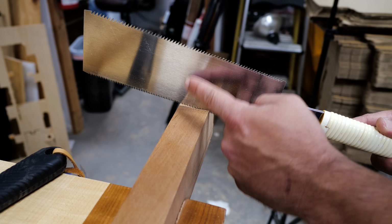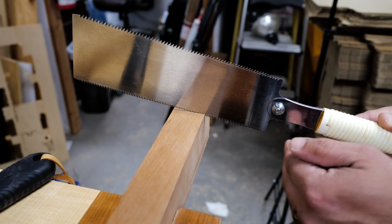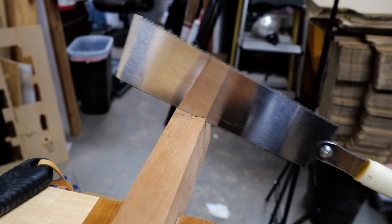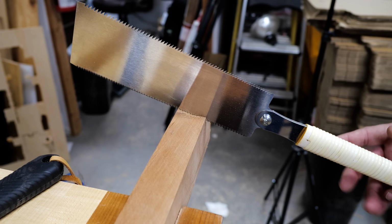And when you're cutting with a Ryoba, you can use 1 or 2 hands, and I just look for the reflection in the saw. You don't want that board to look like it's not a straight line. If it's a perfectly straight reflection, it's going to give you a really straight cut. And you pull towards you, you let the saw do the work. You don't push down in any way, otherwise your saw is going to just start to go.